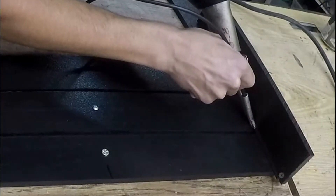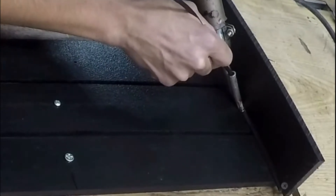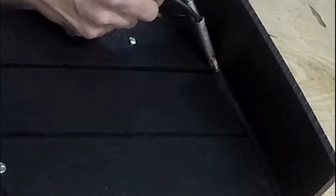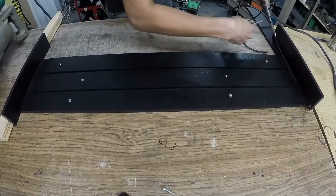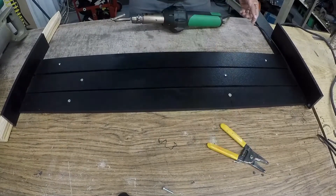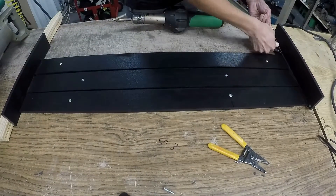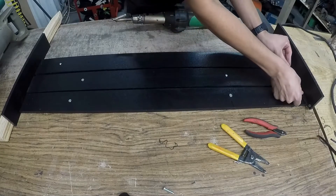I'm slowing down a little bit to show an area where it's too hot — you'll see a little squeeze out. Basically what you want is a nice smooth motion, and you'll have a tad bit of squeeze out on the left and right side. Make sure you have your cutter in hand, because if you don't, you're going to tangle up that welding rod and it'll be a mess. If you want to build up that weld, you need two or three passes. I'm cutting off that end piece with the standard cutter. To build up the weld, just add one more strip with the hot air tool.